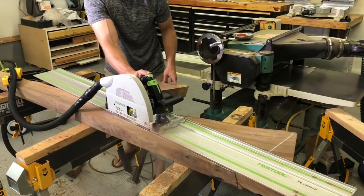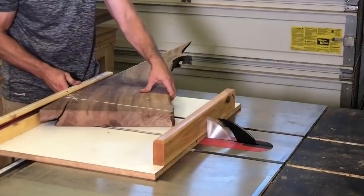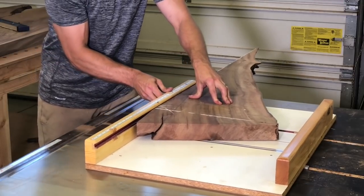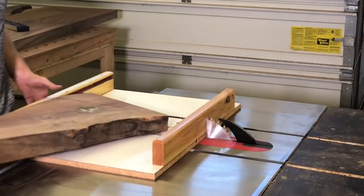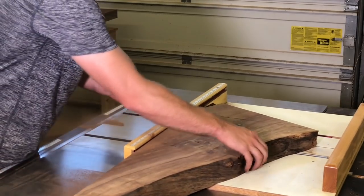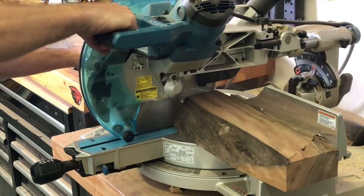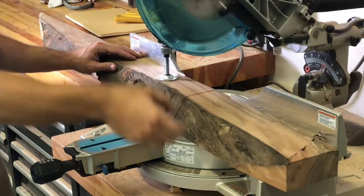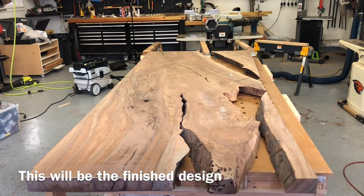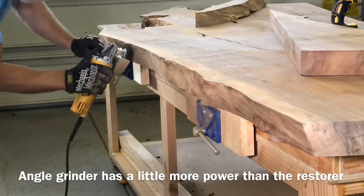These tracks really do make jobs like this infinitely easier. I highly recommend getting one — it doesn't have to be a Festool. I love the Festool one because it's the deepest cut of any of them, but I highly recommend getting one. I also love using my table saw crosscut jig whenever I have the chance — it's a nice safe tool to use. Wasn't quite a deep enough cut so I had to flip it over. I even worked my miter saw into this build. This small piece in the bottom right was actually a client's request, and I didn't like the idea at first, but once the table was finished I couldn't imagine doing without it — so a piece of advice: actually listen to the clients, they occasionally do have some good ideas.